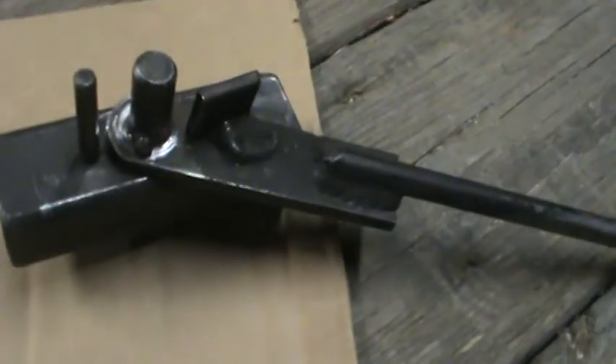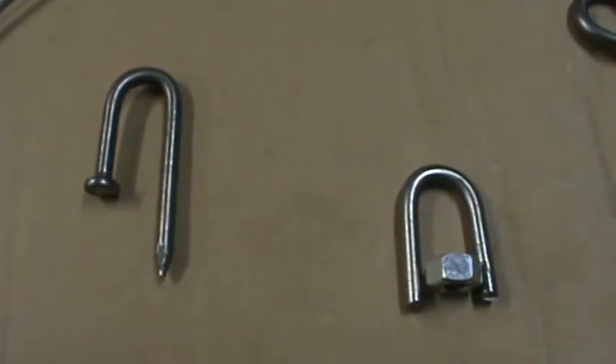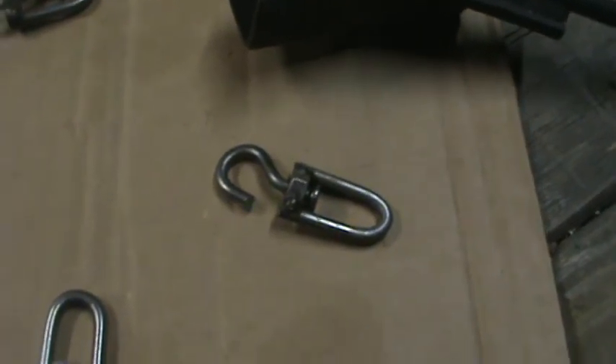I use this bender, but as I said, you simply bend a 20-penny nail in half, weld a 5/16th nut on it, and you've got a perfect swivel. All right, see y'all later.